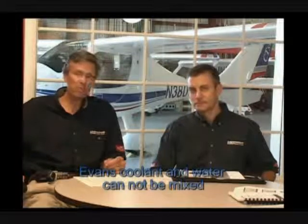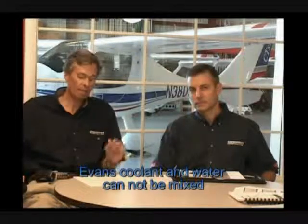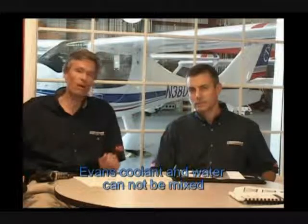Evans, if you're using Evans, you must completely purge the system of all water and all conventional coolant before you add the Evans. And once you've switched to Evans, you can absolutely not add any water to that system. So, you can only top with Evans.